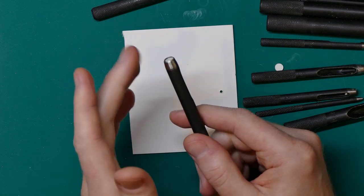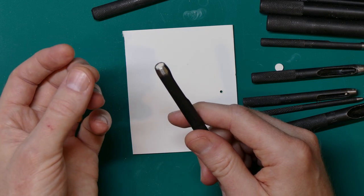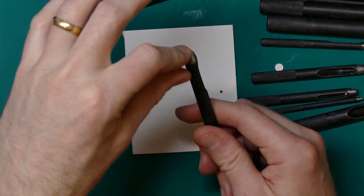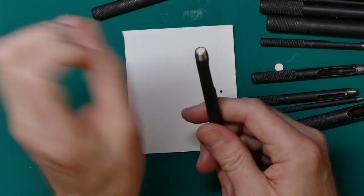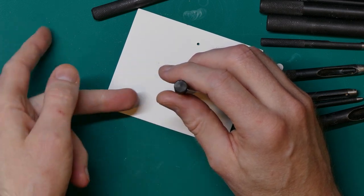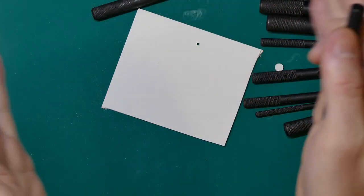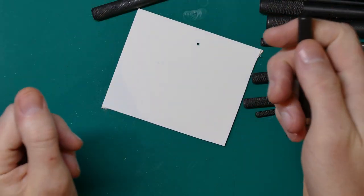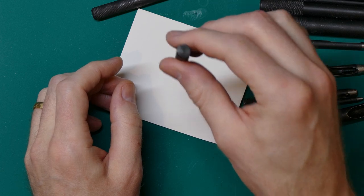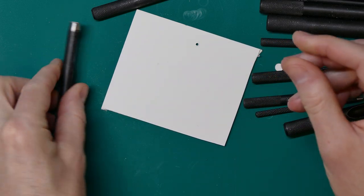Because of the shape, that's fine if you're cutting through something soft that will move out of the way as you push the punch through - like leather - so you get a hole the size of the front and everything else gets pushed out of the way. If you do that on this kind of cardboard, when you push all the way to the bottom you get a hole that is bowl-shaped, bigger at the top and smaller at the bottom. The actual hole size will technically be bigger if the punch goes more than all the way through, which it can do.